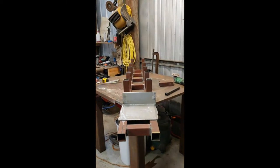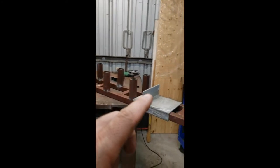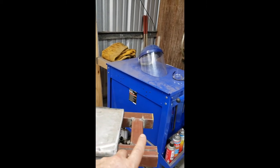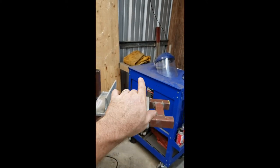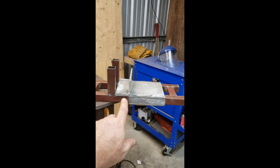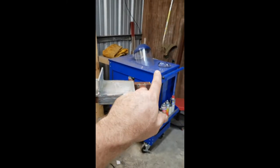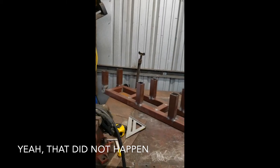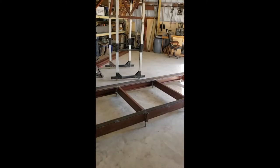It's making pretty good progress and I'm really liking the way it's looking. I was a little concerned about the strength of this, but I'm pretty sure this design should be strong enough. I'll probably come in at 45 degrees with some inch-and-a-half on both sides just to give it a little bit of strength so it doesn't bow, because there's about a 19 to 20-inch gap with no bracing other than the piece that goes all the way across. We're going to go ahead and get the carriage back mounted on the rails and move on to the rest of this.